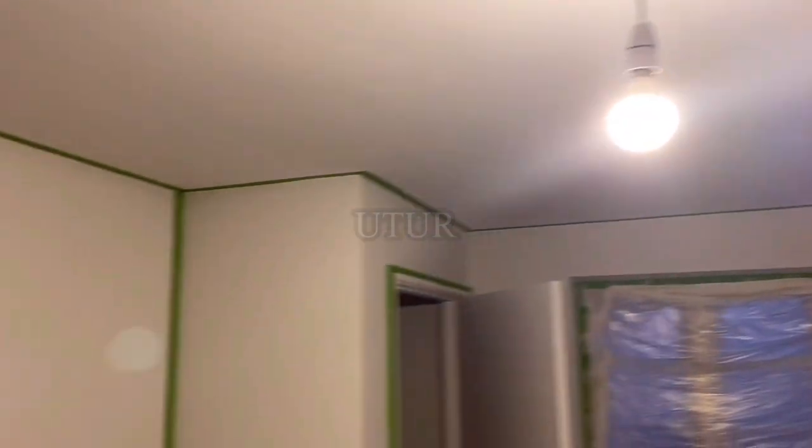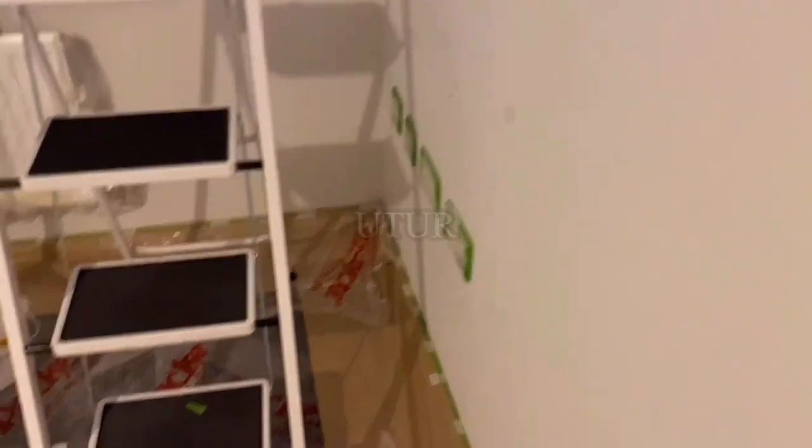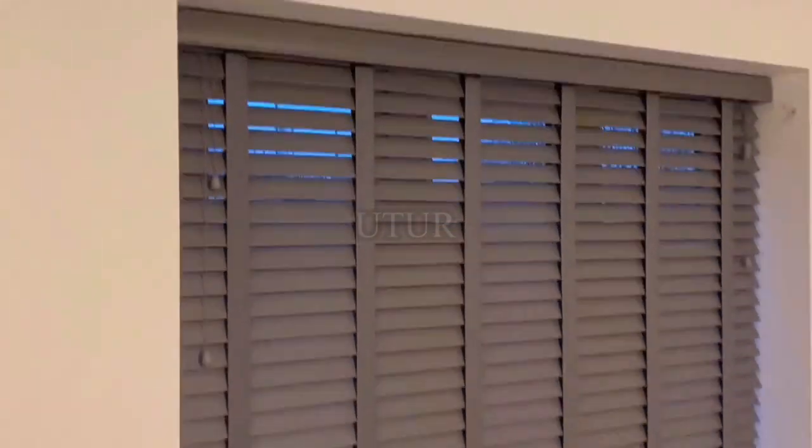Here you've got the diamond white brilliant matte, and over here the obliterating emulsion white which will be used on the ceiling. It comes in 2.5 litres. After visually inspecting your prep work masking, get some yellow and white paint into the tray liners for painting. Prior to painting, make sure you visually inspect all of the prep work — make sure the corners have been prepped with masking, mask around your sockets and switches, mask around your door frame, and around your skirting.